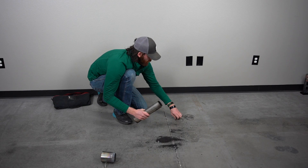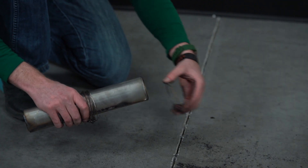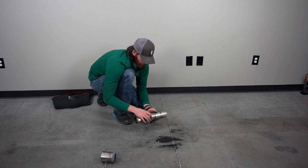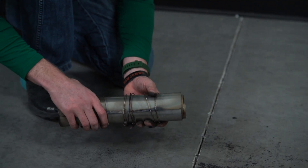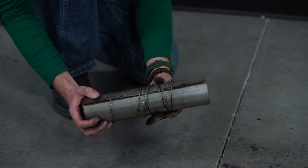Make sure you don't let go of everything. While you have it here, take these rings and place them back on the stove pipe, then slowly start releasing pressure — kind of spacing your rings out a little bit — to the point where eventually your stove pipe holds its rolled shape.